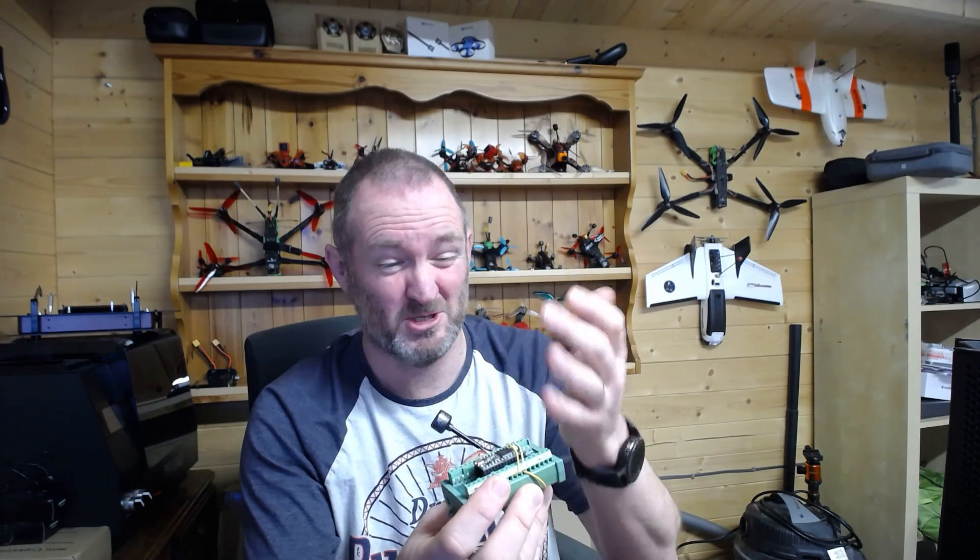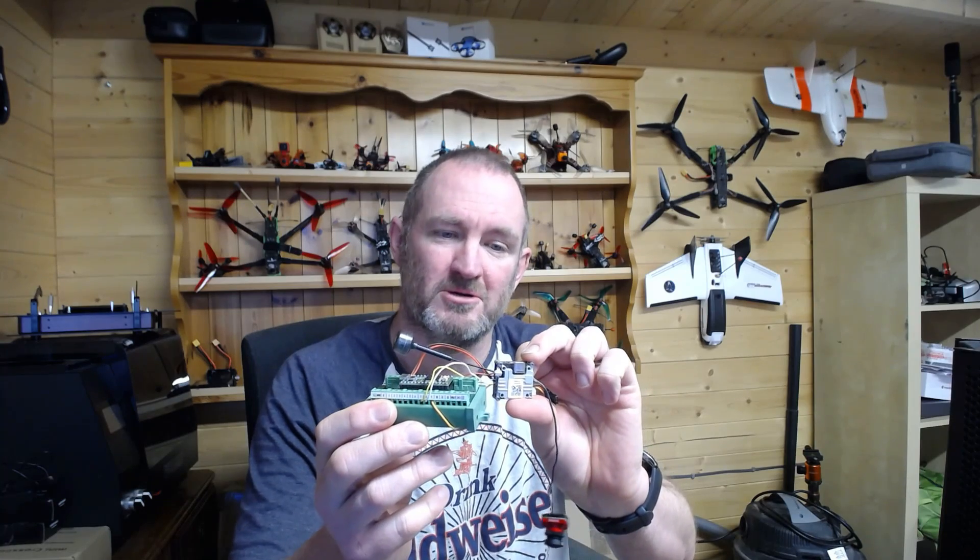What do you got? PWM comes out of a regular receiver — in this case, it's a Jetty receiver. And when you toggle a channel on your radio, the signal will go from one extreme to the other extreme as a PWM signal. So what I've done is I've said let's get a tiny Arduino. In this case I'm actually using a Teensy 3.2, which is kind of compatible with the Arduino anyway. Essentially, this here is listening for that PWM signal change, and it says, 'Oh, you've changed the channel.' Then what it does is act as a translator to take that channel change and sends it via the MSP protocol to your air unit. The net result of that is that for what weighs about five grams of board — and if you did this with an Arduino, it probably costs you back maybe six pounds — you can effectively put on a switch to toggle and tell your air unit to do exactly what you want it to do.